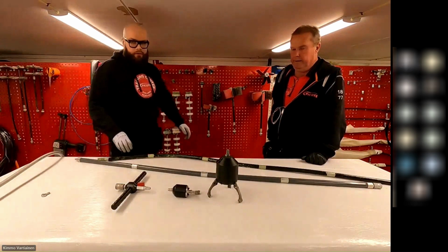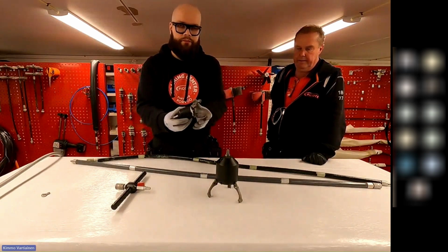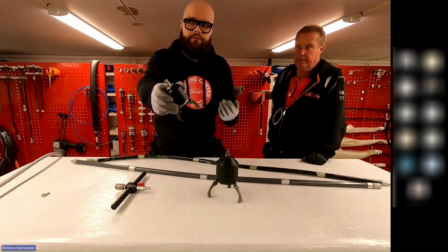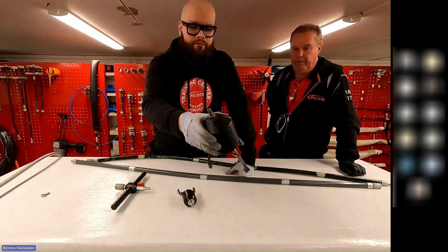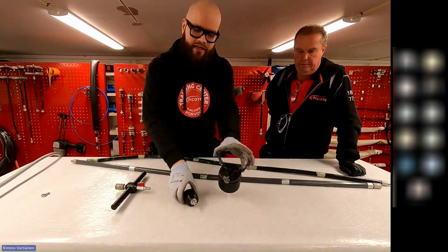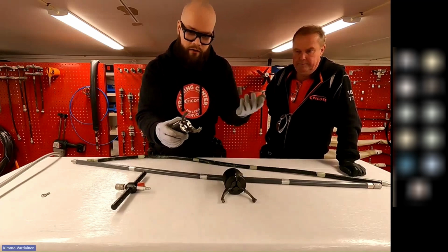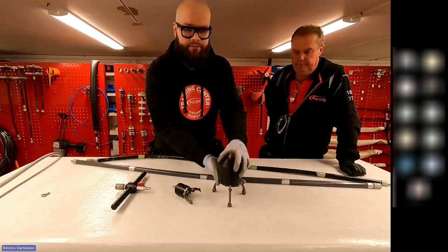All right, guys. So here we have the grabber for push rods, and it has the same connector as the Packer and the Picote deconnection system. And then we have the 6-inch version, which I believe is coming up, but this is how it looks. So it has 3 jaws, and then we have the small one with the 2 jaws. The 2-jaw version is for 4-inch pipes, and of course you can use it on the bigger pipes as well. And then this is for the 6-inch.